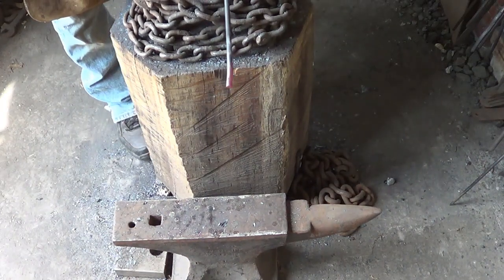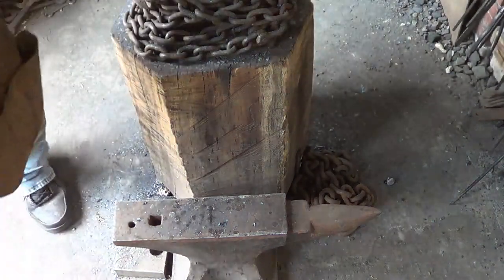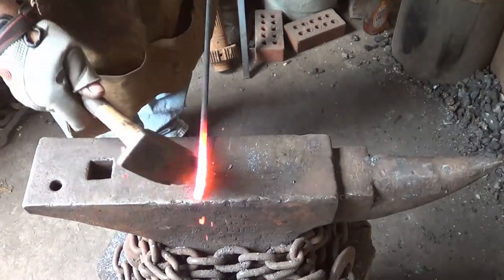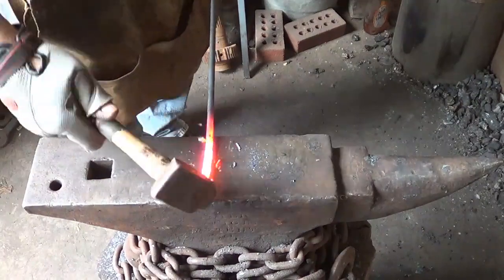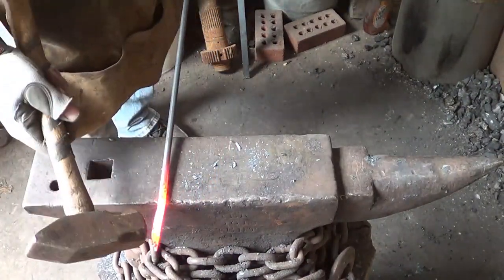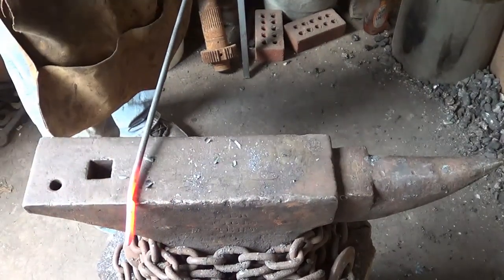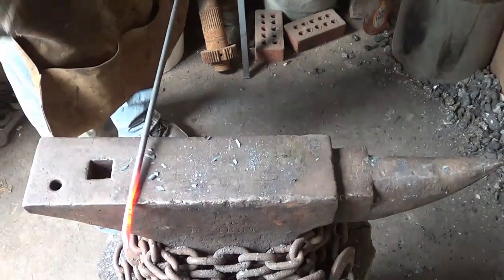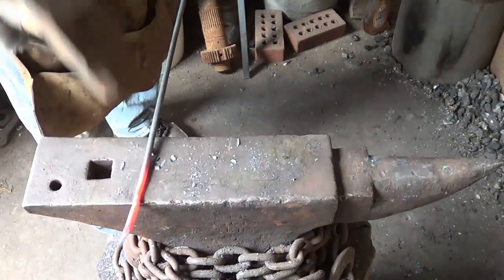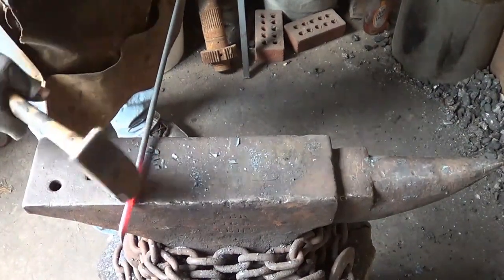Not a major upset, but just enough to get a lesser heat there. Go back in the fire for the leaf heat. We've got a happening going on this weekend, so we're cleaning up outside. Put a little taper on the front — about 2 to 2½ inches is what you're looking to get enough heat for that leaf. You're not going to go quite down as far as you would for a full leaf because the stem — I don't want it too thin. I come back maybe another 2 inches on the taper just to make it look hammered. Very often this is all done in one heat.